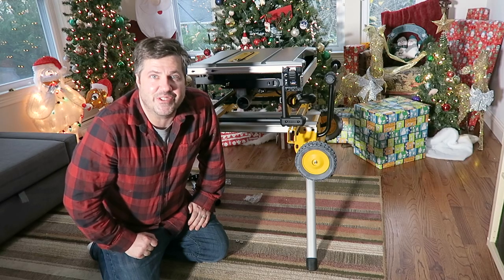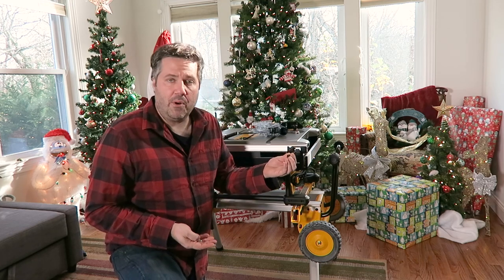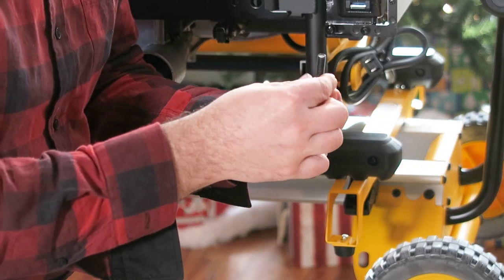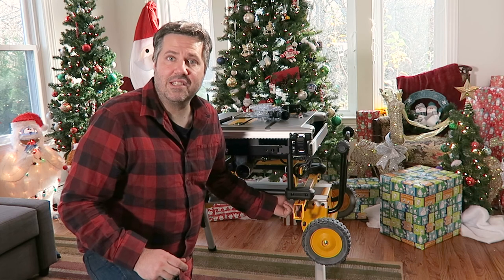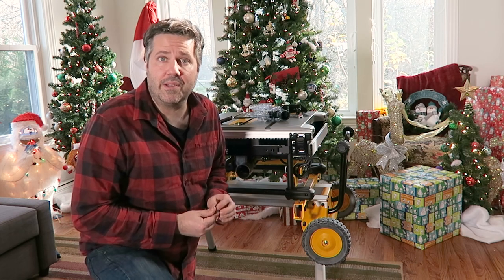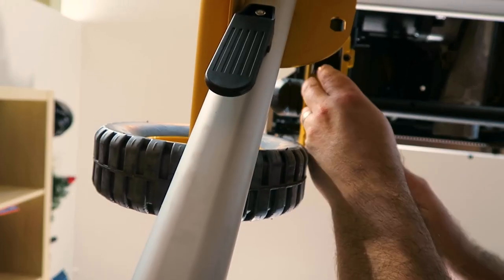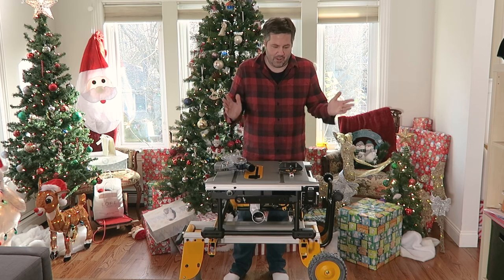There's really no recommendation in the instructions on the best way to mount the saw to the brackets. Here's how I did it: the kit comes with bolts, lock nuts, and washers. I take a bolt, stack a lock washer on top, then a regular washer, and screw it through the stand. Inside the plastic pieces is a threaded hole, so it fits perfectly and seems correct. If I'm doing it wrong, please leave a comment — but it does anchor really solid.